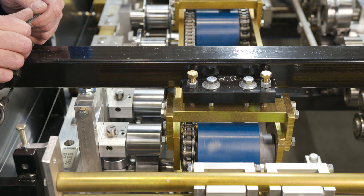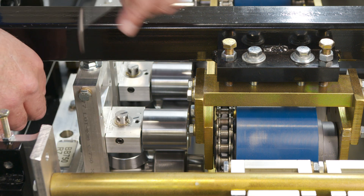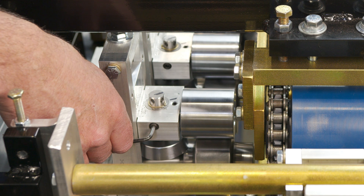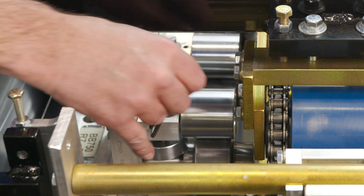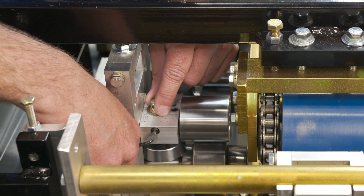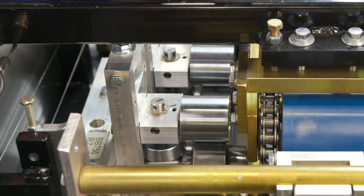After that adjustment for the inside 90, now let's make an adjustment for the outside leg of the board and batten for the 90. This will involve the last camber station, R14. If your leg is overbent — bent in too far and you need to open it up — it's on a set screw marked at home position. Take your 5-32nd Allen wrench, loosen it, and turn it clockwise to open it up and relax that leg to 90. Move it about a 32nd of an inch, lock it down, and that will open up your leg to a 90. If your outside leg is underbent, open up the set screw and turn counterclockwise about a 32nd, then lock it back down. That will bring the roller in, pinching that outside leg, which will make it 90 degrees.